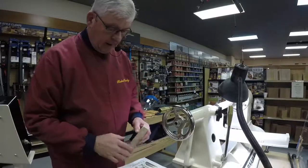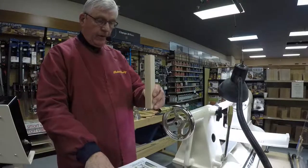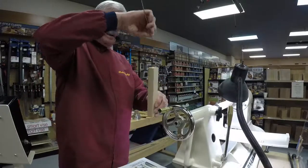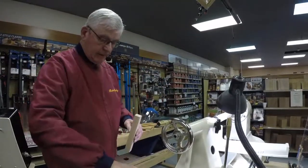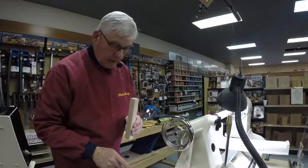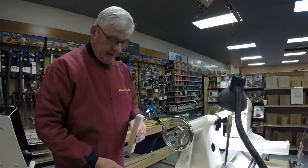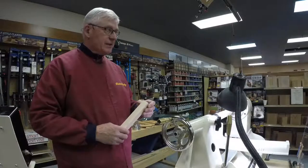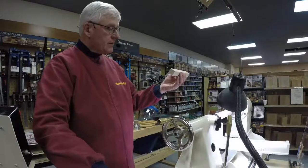Down in number three, at the bottom, what I started with is I got this lined up for the drill press and did a starter hole, which goes in about an inch and a half or so. I tried very hard to get this lined up so that it would go in straight. If you look carefully, I've got a 30, 60, 90 degree right triangle that I've used to line this thing up. It's plastic, so it's hard to see in the picture, but it's there. And that's what I've done to get it started.